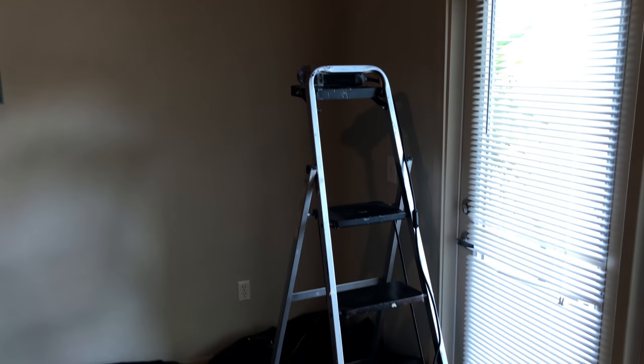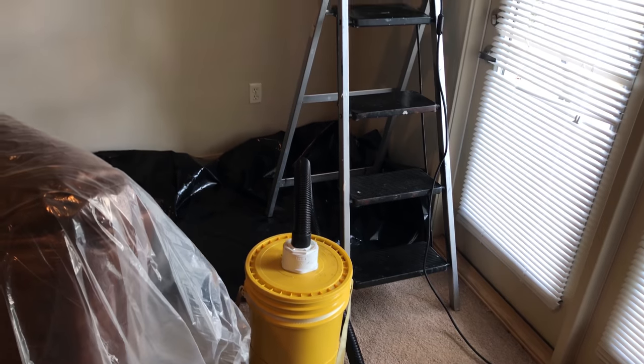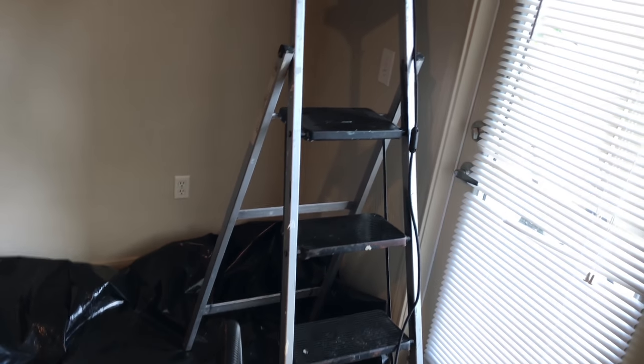So I was going to go through the upstairs floor to begin with, and went upstairs and drilled. And it's some fairly new apartments. Got all the latest and greatest code requirements. So the floor upstairs is two layers of 3/4 plywood plus a layer of firebreak. And so I just decided it would be way easier to come in and cut a little hole in the ceiling. That popcorn texture is easy enough to match back.